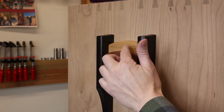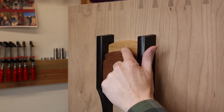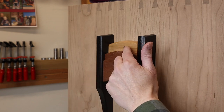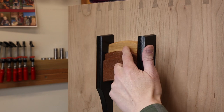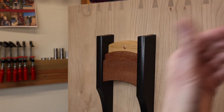The wood on the end looks very light because I've sanded it and haven't applied finish yet. When I get some finish on there, the sapele end grain will darken up considerably and provide a nice contrast to the copper edges of the plug. Before finishing, avoid handling the metal — the oils from your fingers can tarnish it. I like to use a film finish such as de-waxed shellac, which sticks to pretty much anything including metal, or Vermont Natural Coatings PolyWhey furniture finish. Either will protect the copper and keep it nice and shiny.